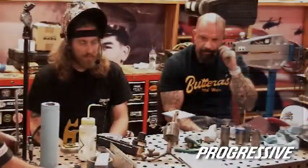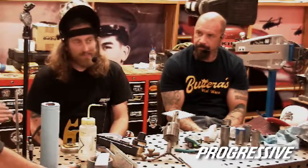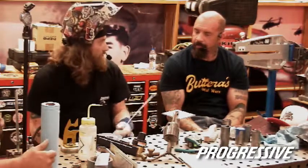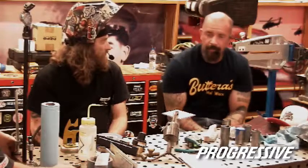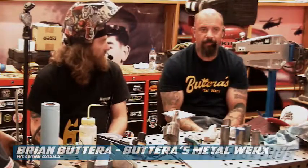Right. I mean, if you're doing mostly stainless, would you go to just a stainless one, or again, you're comfortable with what you use? Yeah. So find what you're most comfortable with and run with. Tungsten-wise, I've always used the 2% thoriated. It has always been just what was thrown my way, and I stuck with it. I think it's good and versatile.